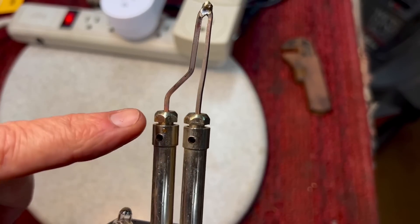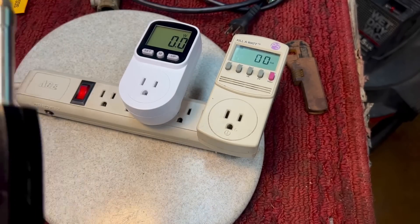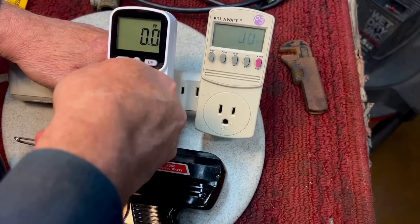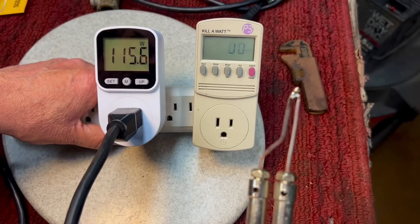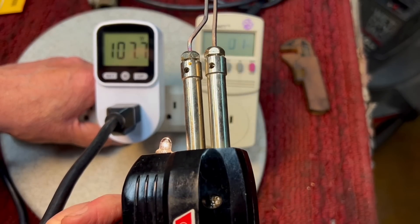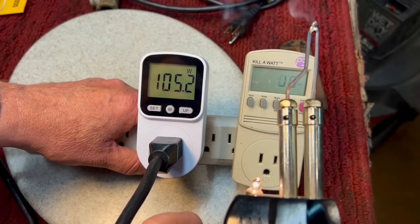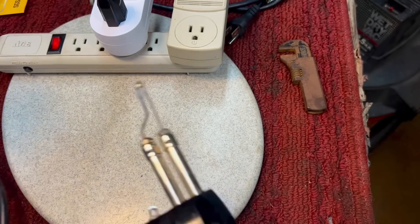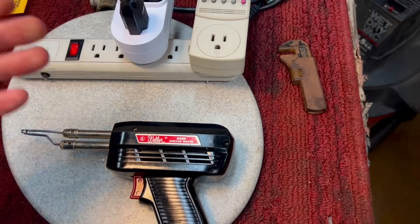We cleaned up all the inside of the contacts — got it nice and shiny copper, which is what it's supposed to be. Also cleaned the edges. Now put it back together — you've got to keep these very tight, hold it down and give it a good tighten. Let's see what this rates now. Remember, the first setting is supposed to be 100 and the second 140, and we only got about half that the first time. Plugging it in — first click, the light is on, wattage: look — 115! Remember it cools down as it heats up, so we're at about 100 watts. Second click: 107, 114. The second setting still isn't quite 140, but definitely hot — you can see the solder coming off. See how just that simple cleaning got this back into better condition.